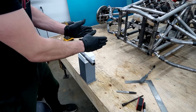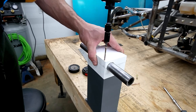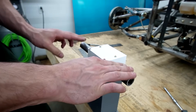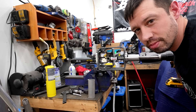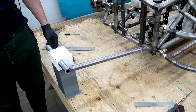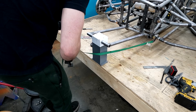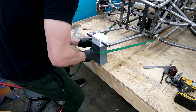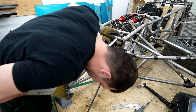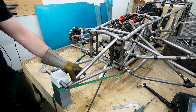Mark this out, get it centerline, put our top piece on and then build from here to there in a little triangle. I made this a lot higher so we can build verticals down from it, and then they can be unbolted so if you need to take the front wing off you can. Let's notch some tube. Jigs are pretty awesome - we're just gonna pull it in slightly to take up the slack. That's perfect. Tack weld that in place. It's like perfect - not a gap to be seen anywhere. I love that for me. That doesn't happen often, but maybe it'll start happening more now that I'm using jigs.